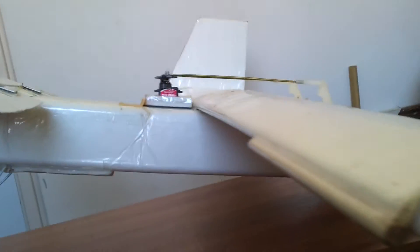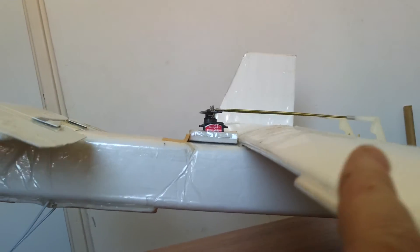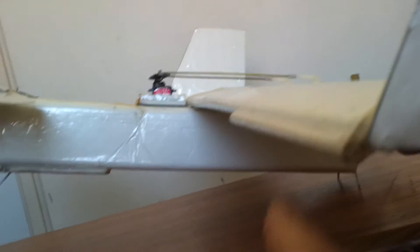The way you can achieve that is several ways, but I think the easiest is to have a leading edge cuff — a drooping leading edge cuff. I just took a dowel and taped it along the leading edge, which provides a drooping leading edge effect. I was finding that when coming in on a slow approach, one of the wings would abruptly stall. Since the engine was off, it wasn't an issue of torquing in the opposite direction of the engine's turning.